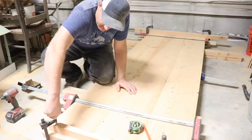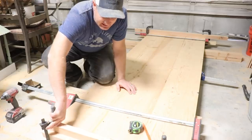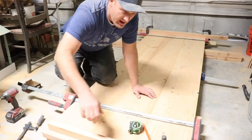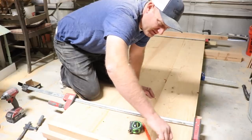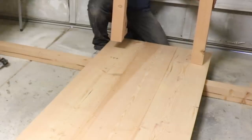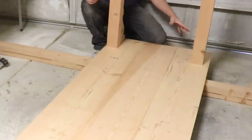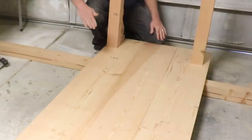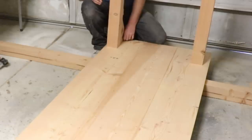The legs are all glued up and together and I'm going to start taking the clamps off of the tabletop. It's been sitting here for a couple of hours now. It'll take 24 hours for the glue to harden up all the way, but it's been long enough that I should be fine taking the clamps off. Now that the clamps are off, I'm going to start to do a little bit of layout and see where I want my legs to go. I need to make sure there's enough room for a chair to fit underneath, and I want to fit four chairs in between so I can sit 10 people at this table.